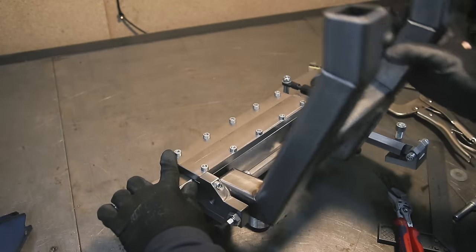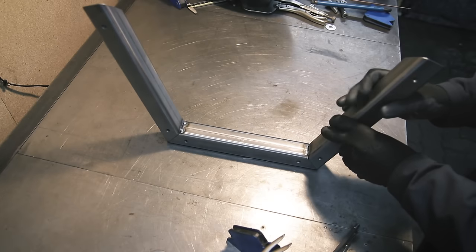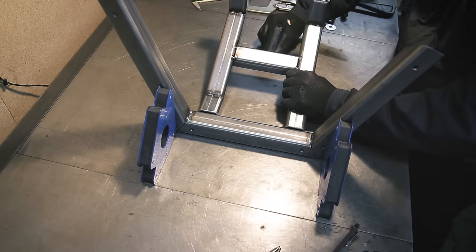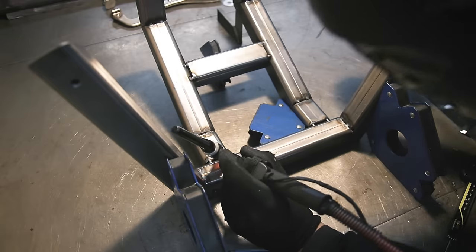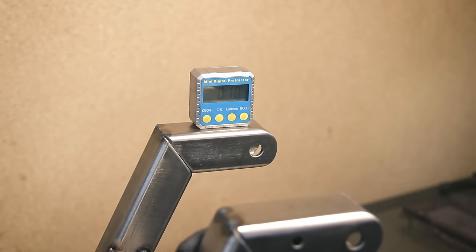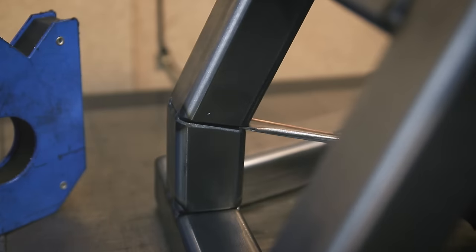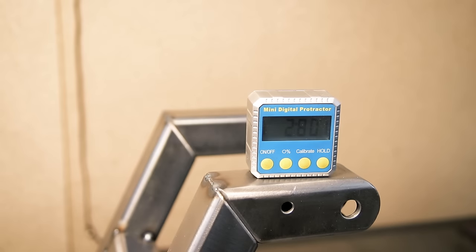That seems to work nicely, so I can remove this part again and then join it with the rest. I was kind of expecting this, but the top ended up not being level, so I used a little trick. I cut open the tack welds on the inside, then started bending the top back, and put some filler rod into the gap to keep that bend in a good position, and then I just cut off the filler rod - the rest is going to melt into the weld puddle. And now it's time to finish up all these welds.